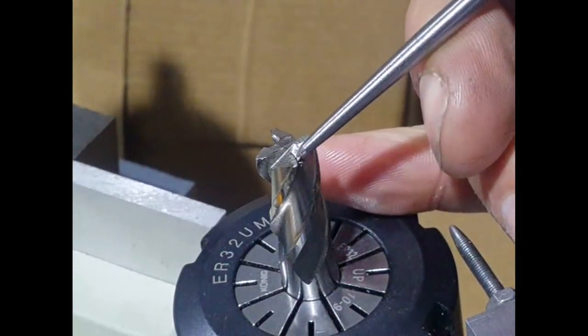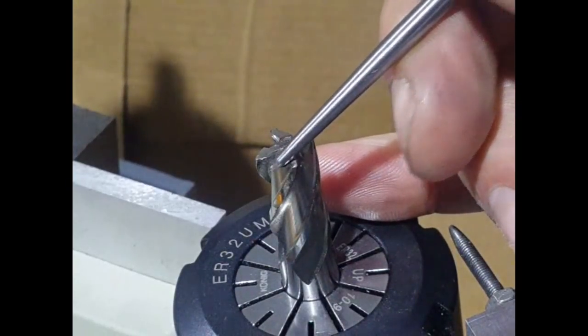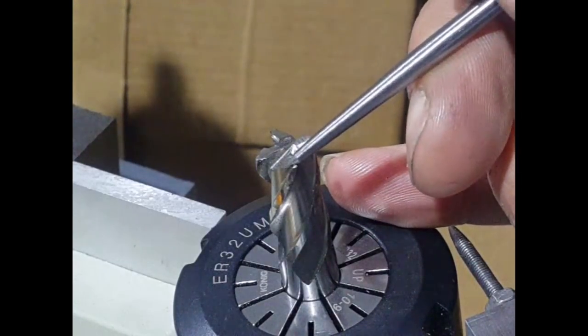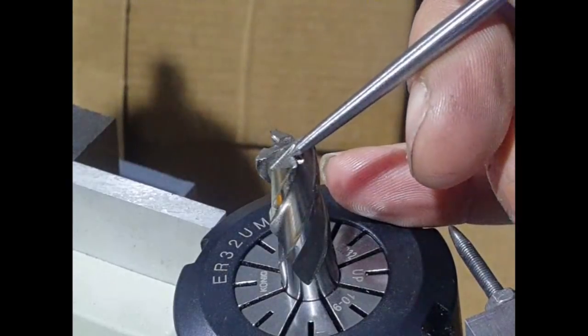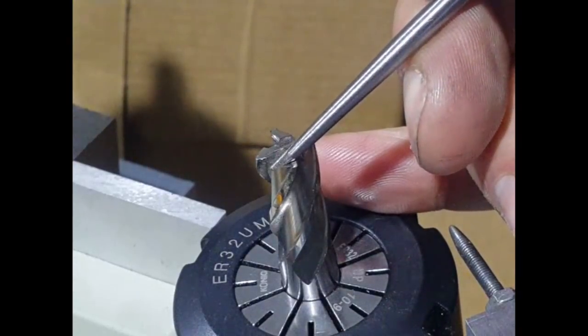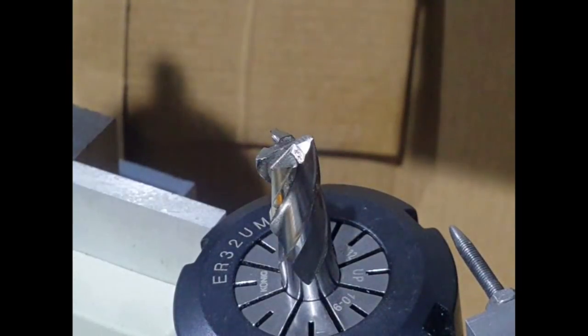The primary angle, also known as the land, hasn't got as much angle as the secondary angle has. We need these 2 angles so that the cutter doesn't bind up with chips coming off as it's cutting. So the back rake, or the secondary angle, allows the chip to disappear, and then it's not just going to clog the cutter up. We'll set that up in the cutter itself and get it all trued up using measurement equipment, and then we'll have a go at cutting. I'm going to cut the primary angle first, and then we'll cut the secondary angle.